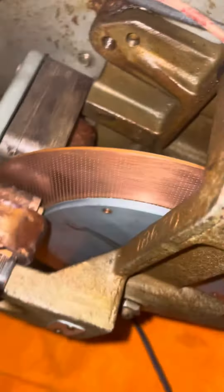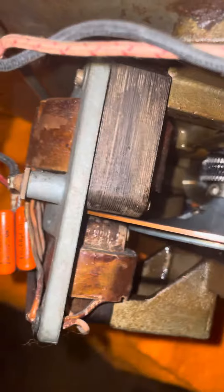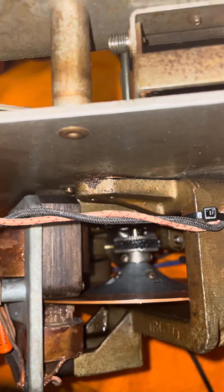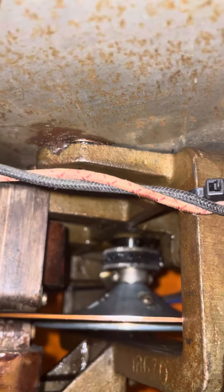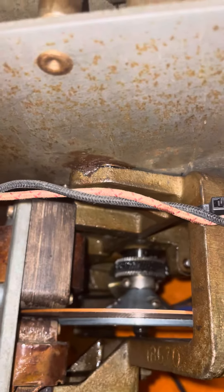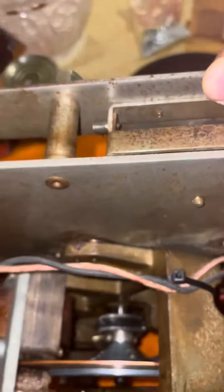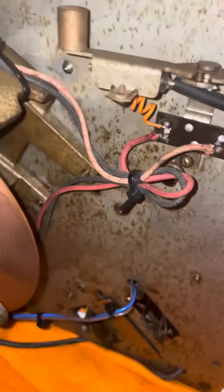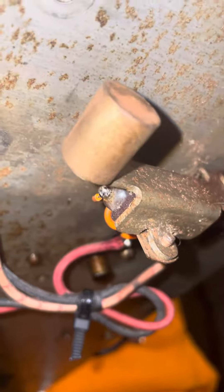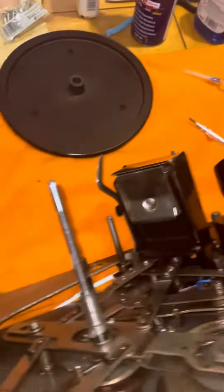This is how it works — that's the motor. You've got two electromagnets with a copper plate, and that spins it around. You need a weight of about two kilos for the centrifugal force to operate the mechanism when it's in full swing. You need that weight going around, and — if I get right in there — that is a mercury switch, and that's what operates it.